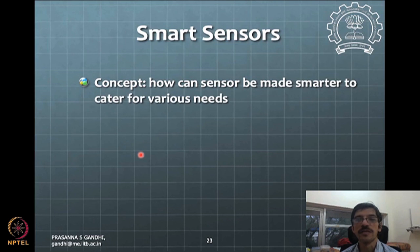So there is a huge difference in the resolution or the accuracy of measurement on one side, if you go for a very small sensor with a very small range, like a gold measurement, versus car measurement. Of course, one sees whether there is a need for such a high accuracy. We don't need the car weight to be known to such a high accuracy, but the point here is that the things which are made to work with a larger range typically give you a lower resolution.